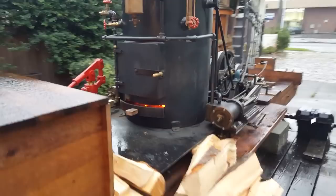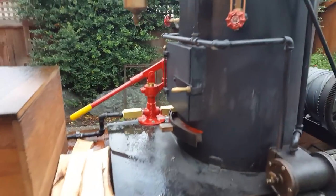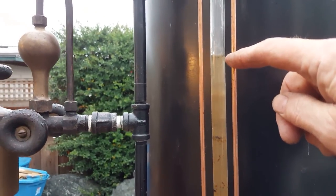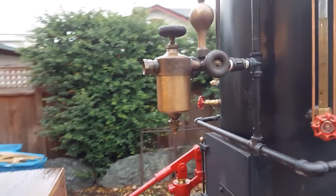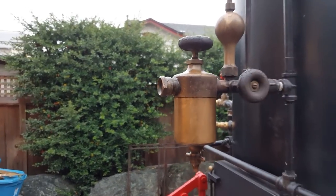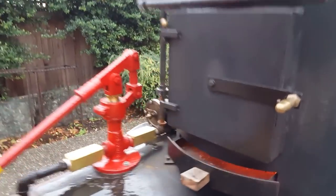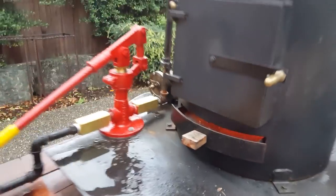That's at about 60 degrees. A couple features to note: always keep your water — I always put it about a little above halfway on your boiler sight glass. You will need steam oil for the oiler; I will ship it full. These knobs I just turn maybe a quarter turn open, one on each side. Back to this — the draft and ash pan.